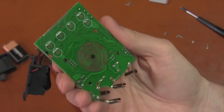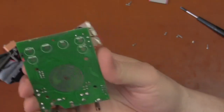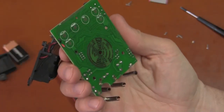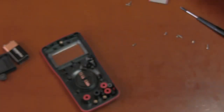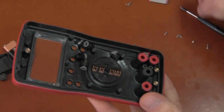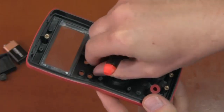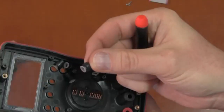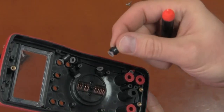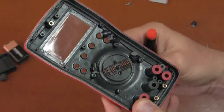The circuit board appears to have a little gold plating on the selector switch contacts — though it's hard to confirm without testing. On the inside, the selector switch appears to have beryllium copper contacts with nice springiness. The button assemblies use a tiny plastic button with a rubber piece inside — an appealing construction. The selector switch feels very nice even with the meter disassembled. Generally, not bad construction at all.